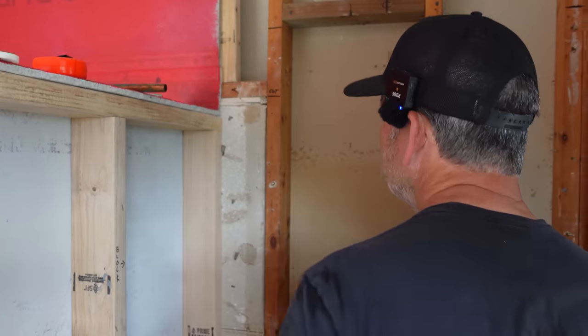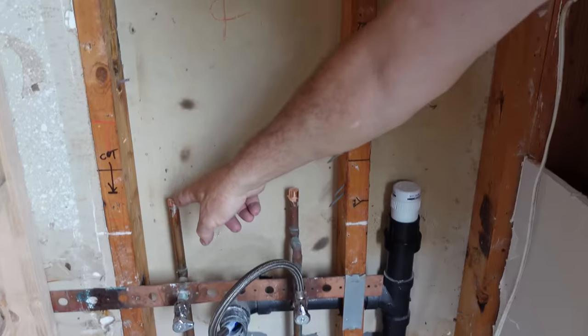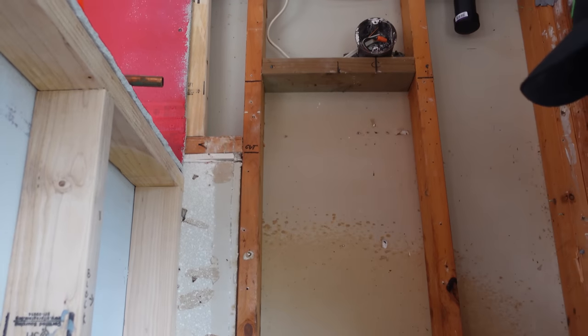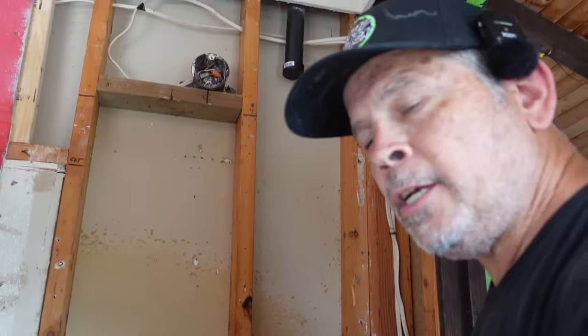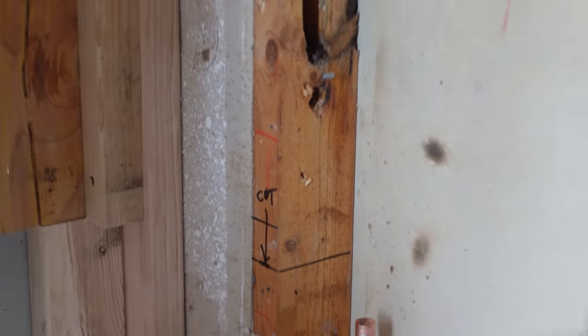A little change of plans — as soon as we got the tile saw set up on the balcony, the vanity showed up. I wanted to get a jump start on the vanity because I need the drywall up over here so the tile can come over and hide the seam between the backer board and the drywall. We've already put the air admittance valve in and lowered the hot and cold hammer arrestors. This is my cut line for the framing so the vanity top can slide back into the wall. As soon as I solder this cap on, we can cut this framing out of the way, frame in a big niche, and put the vanity in here for a test fit. I'll use my reciprocating saw to cut through these 2x4s, remove them, rinse and repeat three times, and we're ready to put this thing back together.